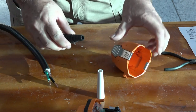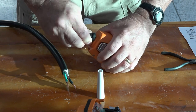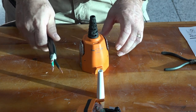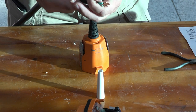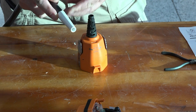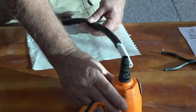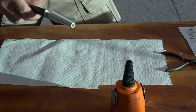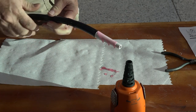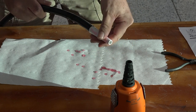The trick is we have to get this big cord through this little strain relief. First get the outer sleeve in here. To get this through that hole, you take all the wires together, put this over it like so, and then put it through. They suggest putting some dishwasher soap on it to make it go through easier — so that's what we're going to do. This is the messy part.